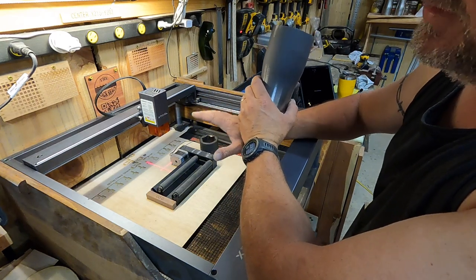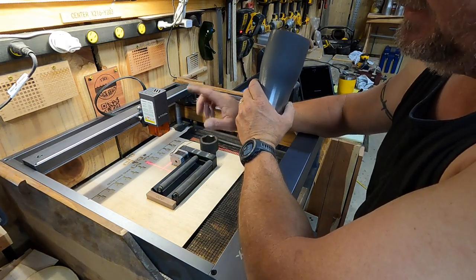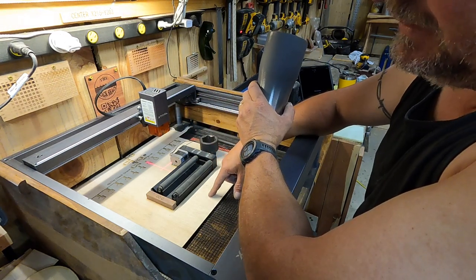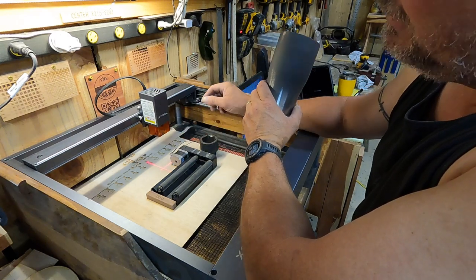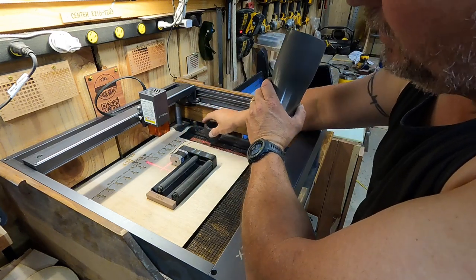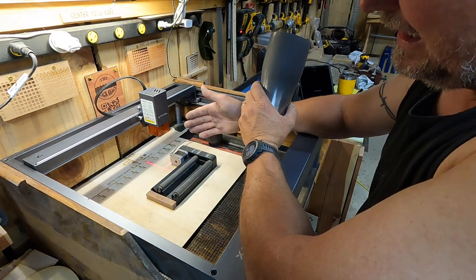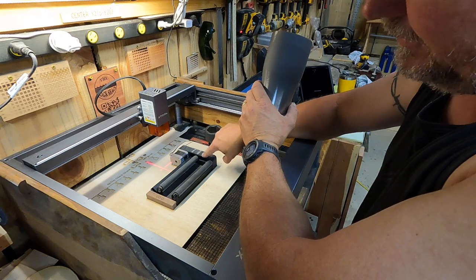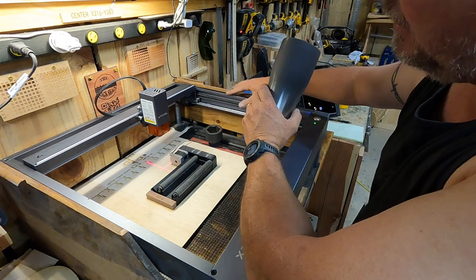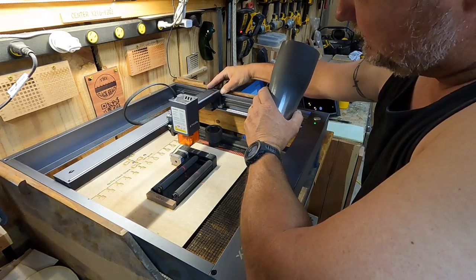But for those of you that aren't familiar, this is the jig that I built for my D1, and it's available on my Etsy shop, and it's handy. I have the rotary jig on there just to make sure that my rotary doesn't move. It keeps it from sliding, and I don't have to worry about it moving on me. When I build a template and create a burn, everything's lined up because the top of the tumbler is going to be on this line here. I've got a mark on my frame that indicates where to pull the carriage to get my laser in the start position.